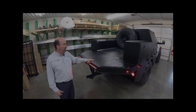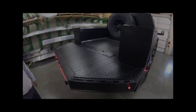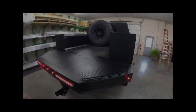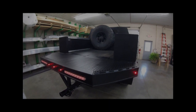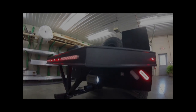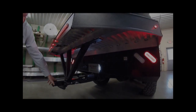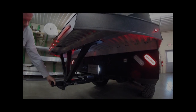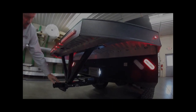The last part of this truck bed we want to talk about is the whole reason the truck came back into the shop this week. The owner had been unable to haul his dual sport bike — there just wasn't enough truck bed length. He asked about a hitch extension, and we did a hitch extension on steroids — about 29 inches and the full width of the bed. We started with a Titan receiver extension, cut down to about 30 inches, extending out a two-inch receiver and still carrying up to about 5,000 pounds.